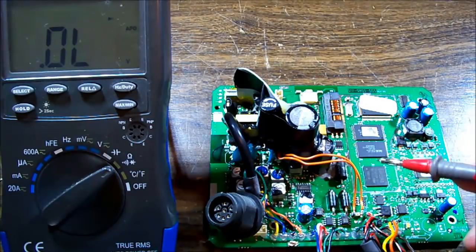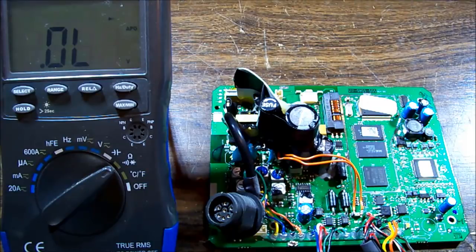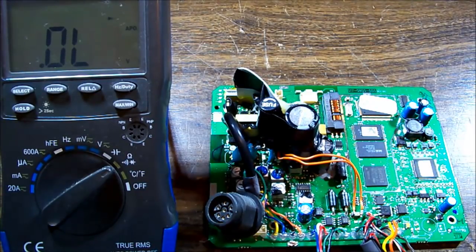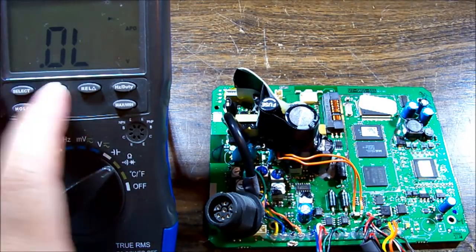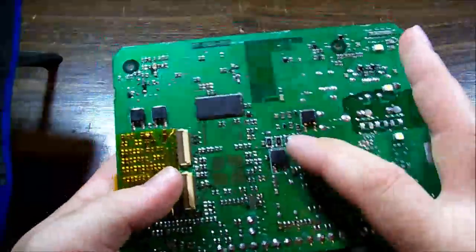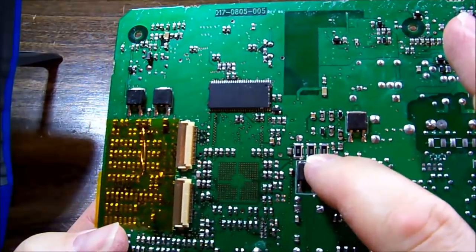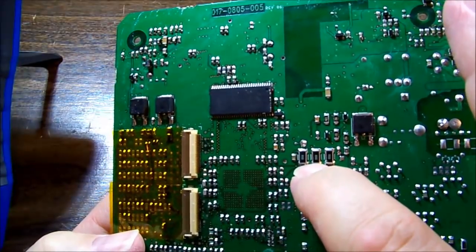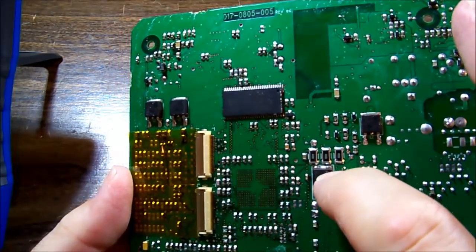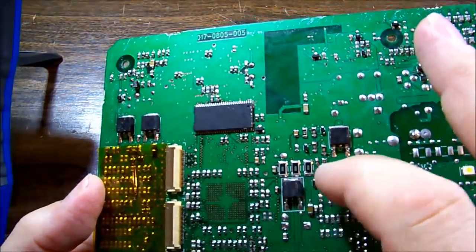So it goes through there, and then this inductor, and then it disappears to the other side. Hopefully there's no internal traces that can lose things in, but so that comes out here. It then goes through a resistor of very low resistance. It could even be a current shunt. They may be monitoring input current.